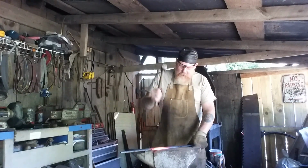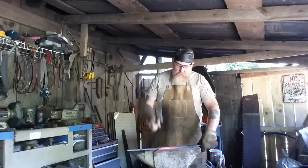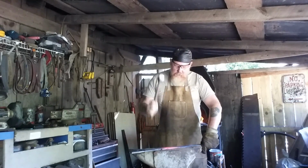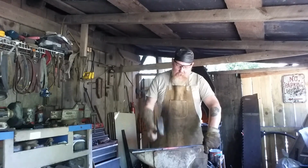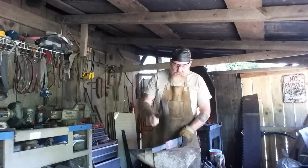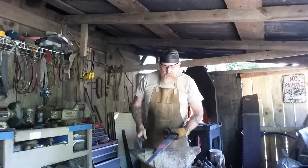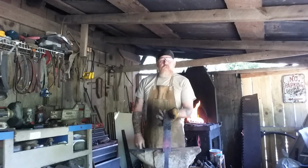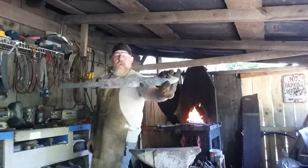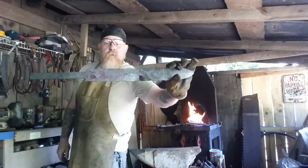You do want to work fast though, and you want to make sure that your hammer is oriented properly, so that you're not going all cattywampus at odd angles and hammering imperfections into the blade. I'm going to try to keep things roughly nice and neat. It looks uniform, nice and straight. As you can see here, still got pretty straight edges, even with hammering in the bevels.